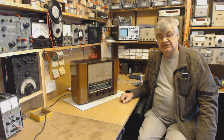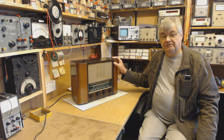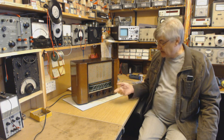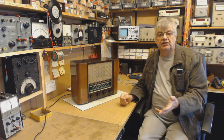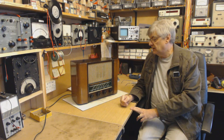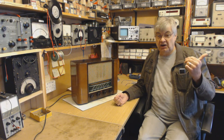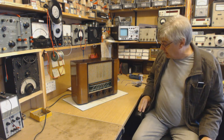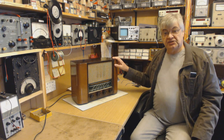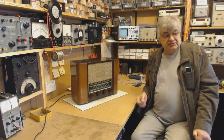So the 49 metre band is the popular one, and what people say to me — they'll get the radio home, they've got long and medium wave — they'll say, what about shortwave, do I need a special aerial? Well yes, a length of wire will do, either around the picture rail in the room, or ideally outside in the garden, as high as possible, say 50 feet long or more, depends on your garden. Plugged into the aerial socket, that should give you pretty good shortwave reception.